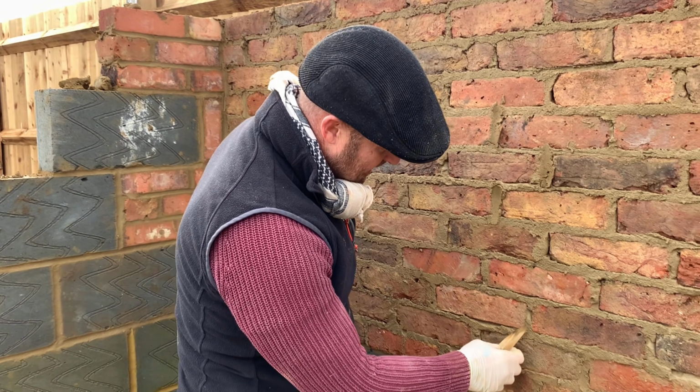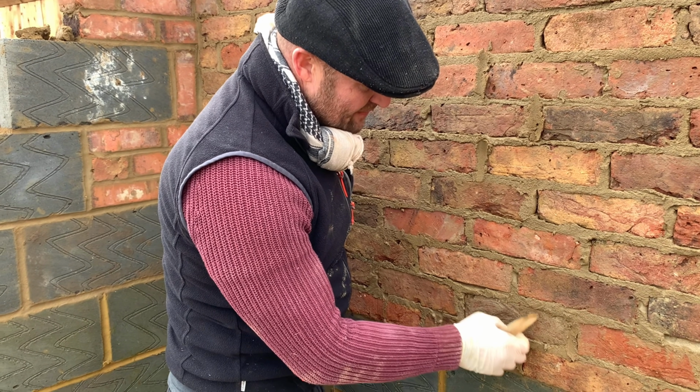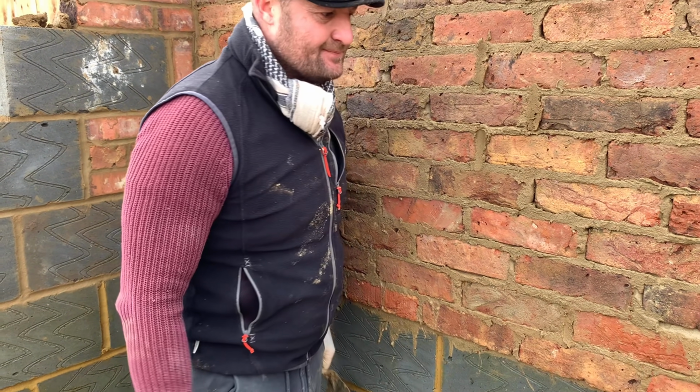Good, okay, she's up. Listen, I made a little bit of a mistake by leaving the bricks out overnight. I think they're going to be a little bit damp, just smearing the muck a bit, give it that little bit of character look. Maybe a bit too wet, as you can see here. It's really come out there. But listen, what we'll do, we'll come back tomorrow and give her a wire brush, and it will give it an authentic look, that sort of smudging, rough look that we're going for with these stocks. So listen, we live and learn, and we're learning every day.